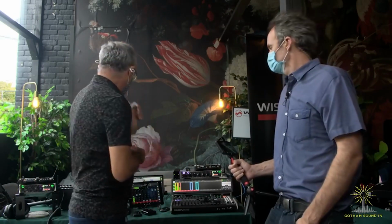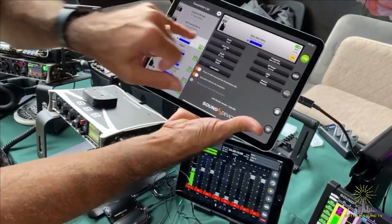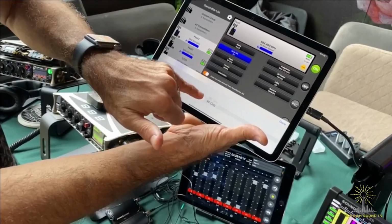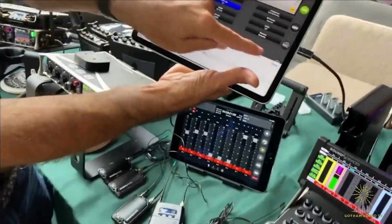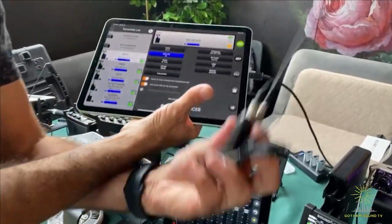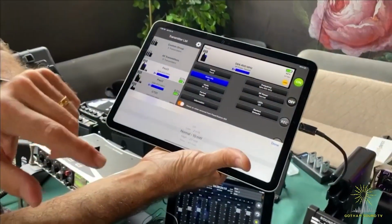Now, obviously, the other things you can do from the app are very much set the frequency for each transmitter. You can mute a transmitter. You can set the RF mode to be RF only or record. Or if you're not in America, you can do transmit and record simultaneously, which we've spoken about already. You can format the record media. Now, the internal drive on the A20 Minis is 90 hours worth of recording, so plenty there. And you can adjust the RF power from here, etc.